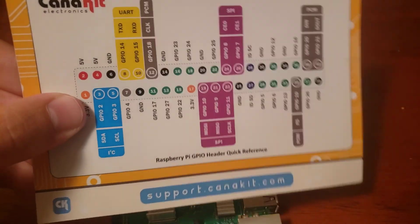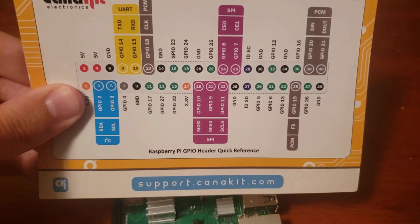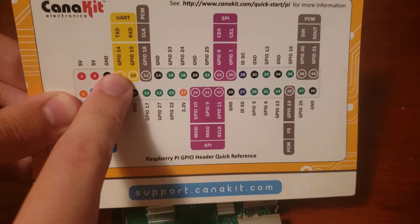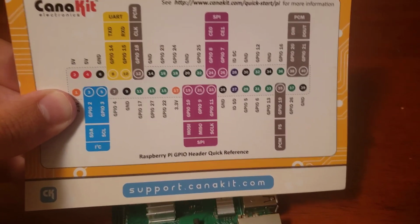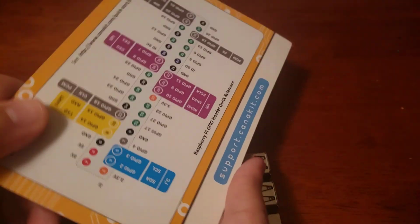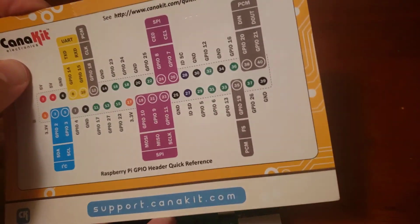Anything else that I might want to mention is that the Pi 4 actually has 2 UART connections on the GPIO, which is super useful. That's why I had to use one for a different project, because we had more serial going out of it. But if you want to use the Pi 3 because you find it cheaper or whatever, go ahead. Besides that, it's basically the same.